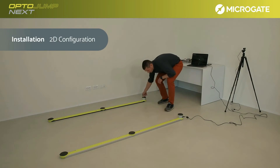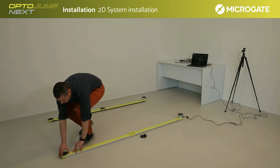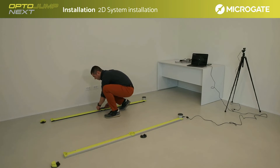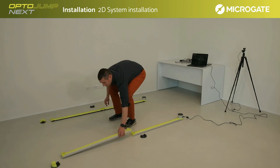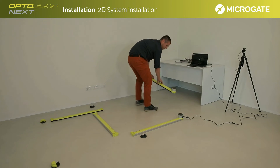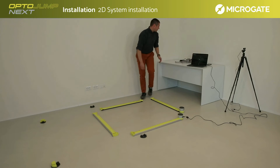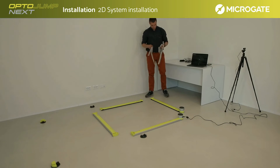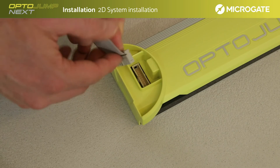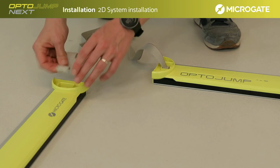The basic kit with an additional kit allows the system to be configured in 2D. To switch from one system to the other, it is necessary to remove the plugs and equip yourself with the flat cables that allow 2D configuration — the flat cables can be purchased separately. Once the plugs have been removed, rotate the bars as shown in the video. Bring the TX and RX bars closer together with the interface and position them at a 90-degree angle to each other. The other two bars should be placed in front of the first so as to form a square. Connect the appropriate flat cable connectors to the bars, paying attention to the indicator on the connector, and make the connection on all three sides with the exception of the interface side.